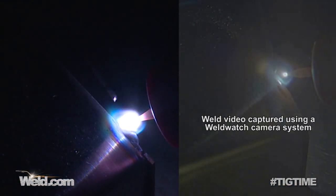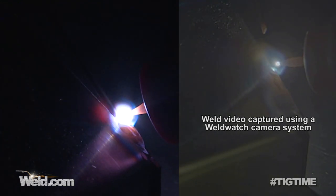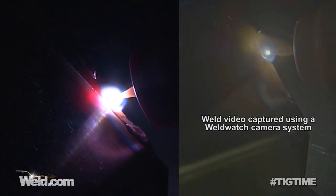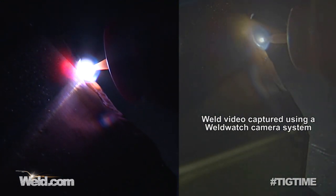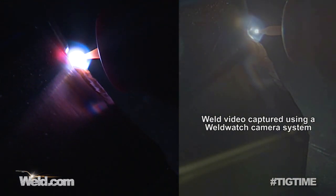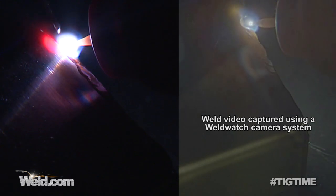I'm welding 304 stainless using a 308L filler material. Corner welds on stainless steel — they're not always that easy to work with; they just don't want to flow right. But this one's doing okay. I finish out the weld, terminate it, oscillate a little bit, back off on the amperage, and that weld is complete.